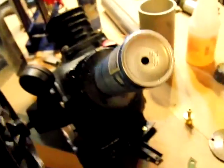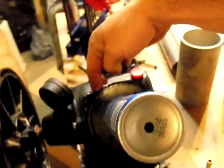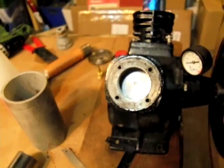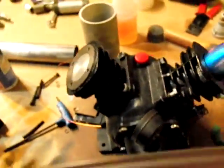What I need to do is place a cover over this so we can actually get the air to expand and push this down. I'll seal this hole up — I'm probably going to use one of these screw holes because it's sealed all the way down, to transfer the air from one side. We're going to put a small copper tube over here to act as a regenerator, and just put a flat plate on this too so there's not that much air volume to bring the air to the other side. I'm your host Dan Rojas — thank you for watching and enjoy our videos.